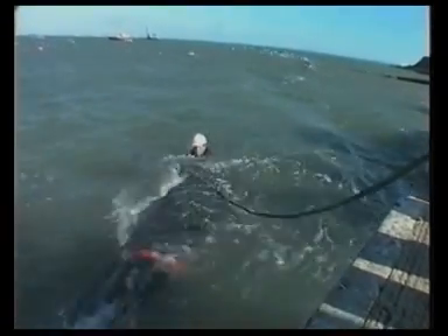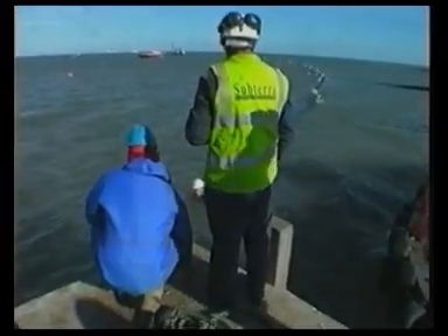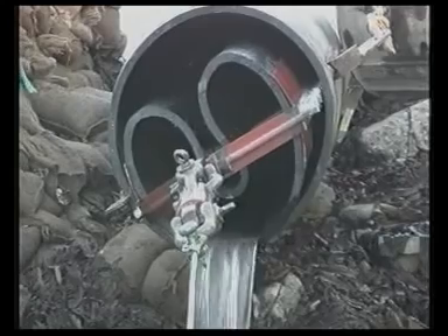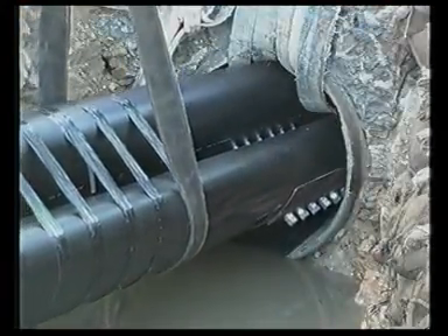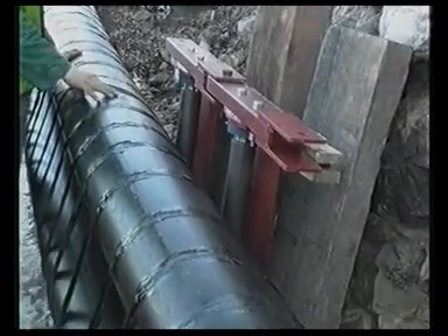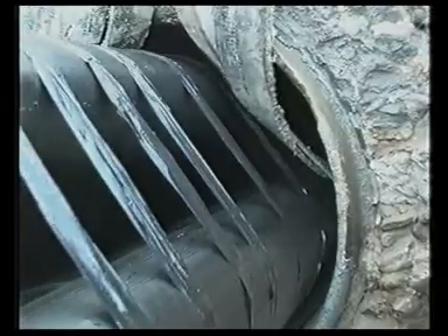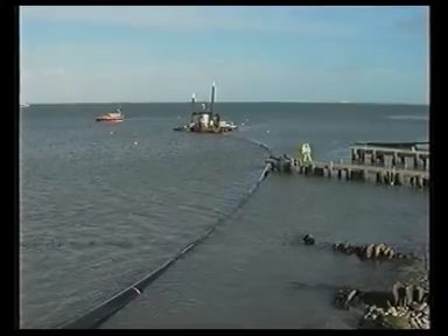The professional divers on the team had to cope with weather, tide and current. But the reduced cross section and the flexibility of the Subline formed liner meant that it was an easy fit inside the full diameter pipe section being used for protection. The liner pipe had been pulled through the sleeve over sea, rocks and other obstacles. The Subterra team guided the liner pipe as it was pulled into the mouth of the old outfall. The deformed pipe can easily handle a curved route, especially with the help of Subterra's experience in designing and fabricating the appropriate aids. The speed of the pull-through ran up to 4 metres per minute with an average of 2 metres per minute, following a curved route underground with the exceptional difficulties of the restricted seashore location.